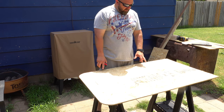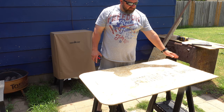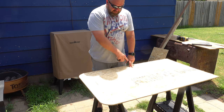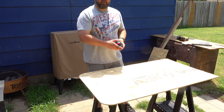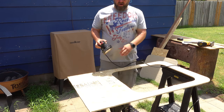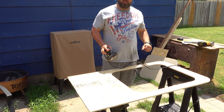I've got the top and bottom marked. I brought it up from the bottom 16 and a half inches. I'm going to get my straight edge again, line up the two marks, connect them, and drill it out. Now I'm going to take a sander and go around all the edges, knock off all the loose wood, and smooth it out before moving on to the screen.